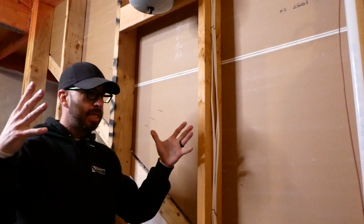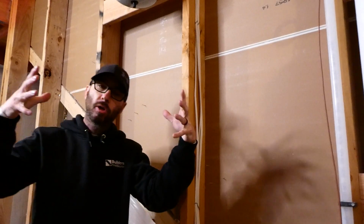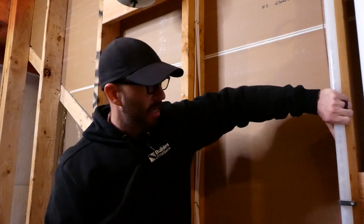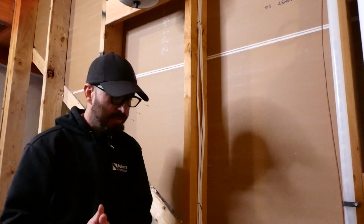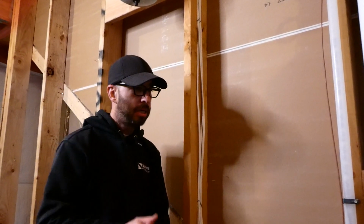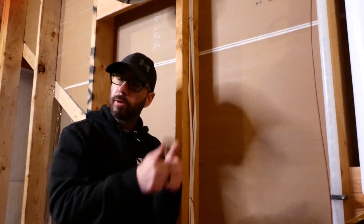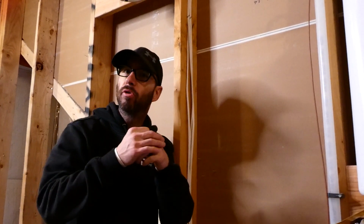Now, as you leave, that water cools down during the day. As it cools, we know that hot things expand, cold things contract. As that water turns cold, it contracts this pipe, which increases the water pressure in that line. So we've all seen old cartoons and videos, you would hear the dripping faucet in an older house. The reason why that happened is because all that hot water that was in the line got cold, the pressure increased in the hot water line, and now the only thing stopping that from bursting out of your faucets are the little O-rings in those faucets.